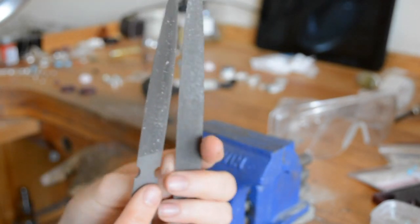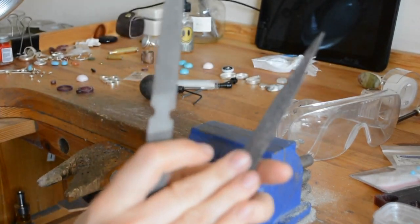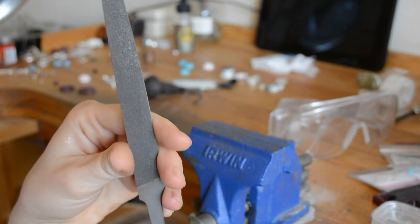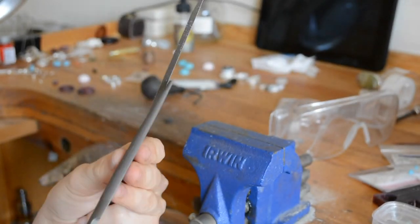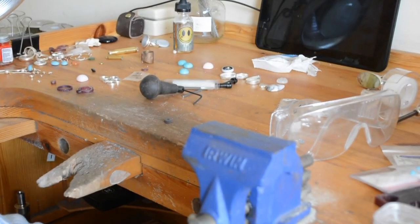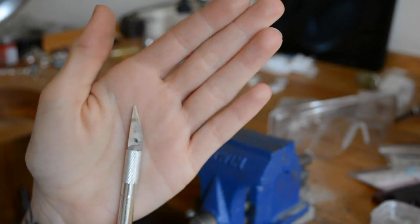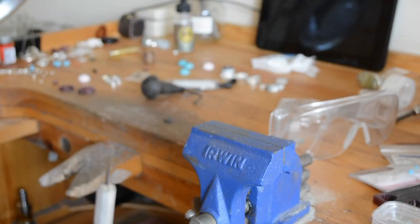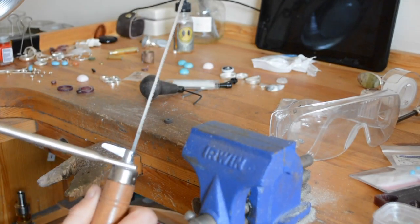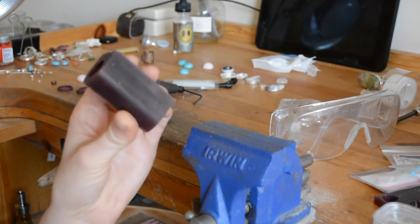Another thing is wax files — the larger ones. This is a very aggressive file that will get rid of a lot of wax very quickly. This is a bit of a finer barrette file, a number two Swiss-made file — I love this one. And this is just a regular wax carving file from Rio Grande — again this one's a lot more aggressive. Another really great tool to have is exacto knives — these are good for creating texture and also getting through fine points and carving out in hard-to-reach areas. A coping saw is definitely useful too — this is a very thick bladed saw, great for cutting through chunks of wax.